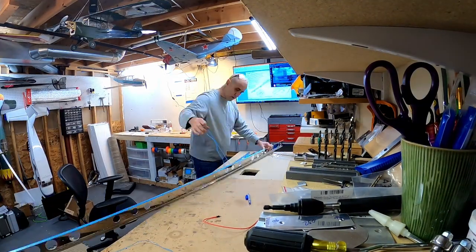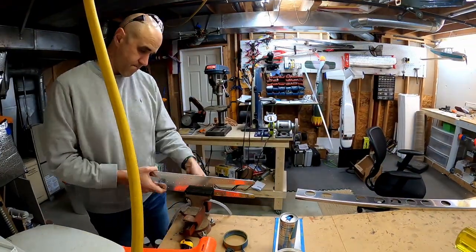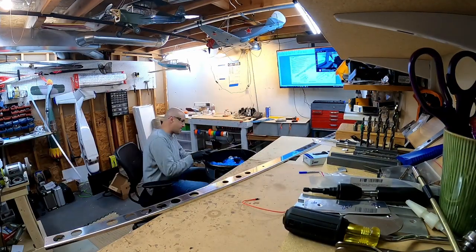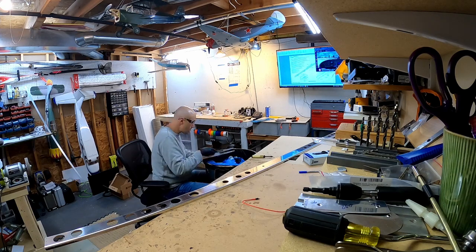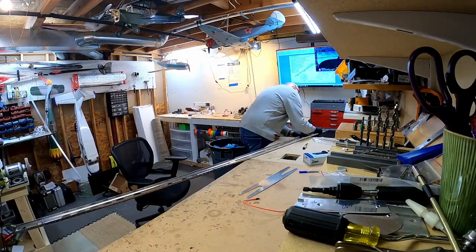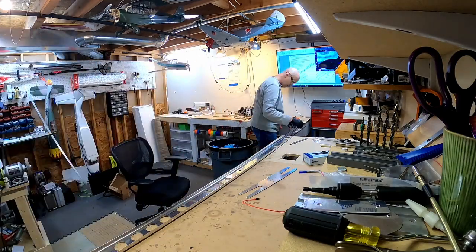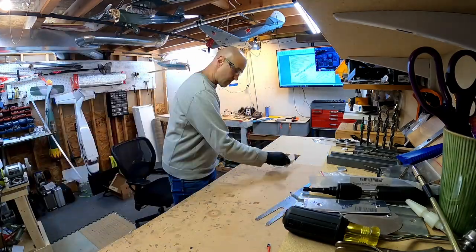Welcome back, YouTube. Today we begin construction on the horizontal stabilizer with a lot of metal preparation. Mostly deburring, so we're going to go super speed through this. And what you saw me doing with that thick piece in the vise was the patented Van's Wang method. Some pieces come out of the stamp pretty well bent, so you throw them in the vise and preload them and hit it with a hammer and, well, it shapes it back to flat.